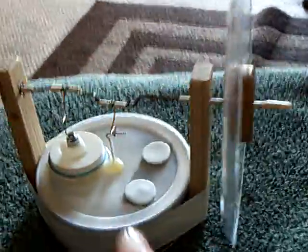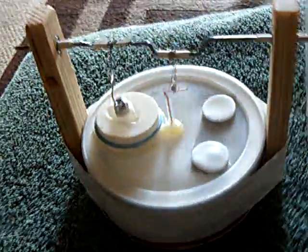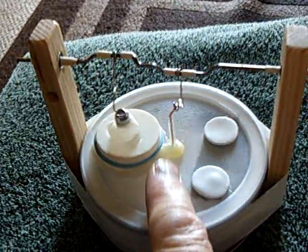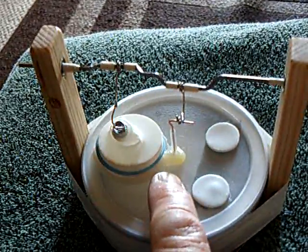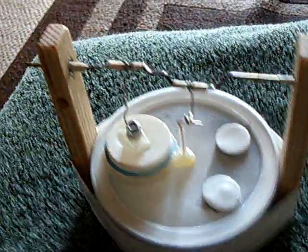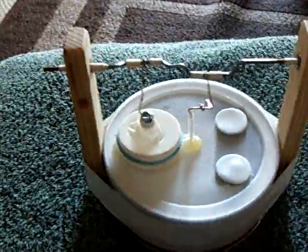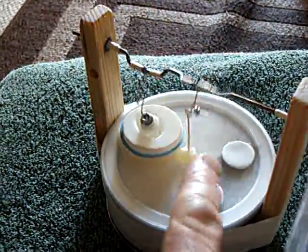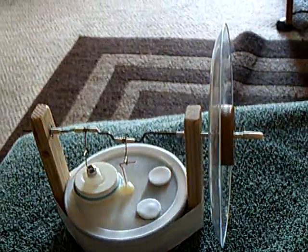Maybe some of you can comment on what you see in the video — it's a foam displacer and some ball bearings on the shaft. I've tried all different kinds of things, but the biggest flaw was using a flexible top — all the pressure went away in the flexure of this surface. The bottom part was metal and the side was thick cardboard, but the top being a flexible plastic, I think I lost all my power in the flexing of this surface. That's my theory.